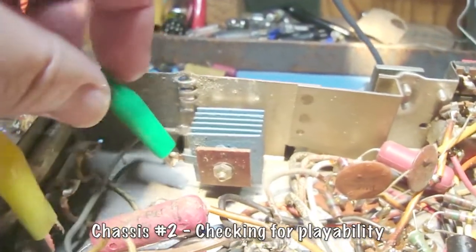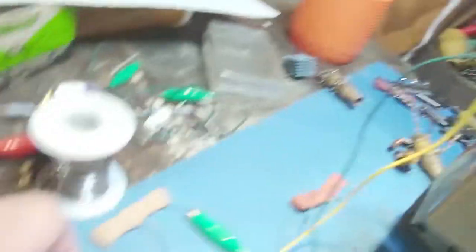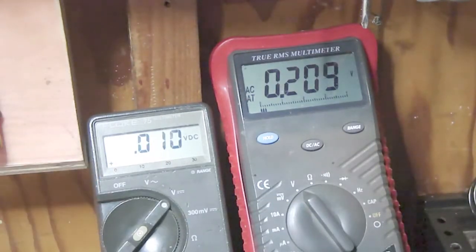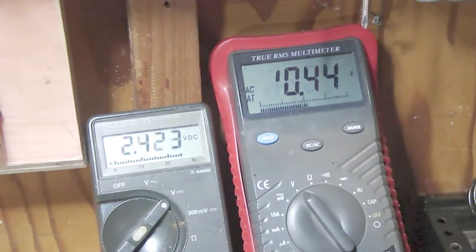The original selenium rectifier — I've got a clip lead here on the end of this resistor. The original resistor on here was in very poor condition and it's falling apart. I have another original one here that I've got clipped on just to test, and we'll check and see where everything stands on the radio. I'm going to leave the camera focused on the two meters. The meter on the right is the variac voltage, the meter on the left is what's actually feeding the resistor from the selenium rectifier. All my tubes are in the sockets in place.